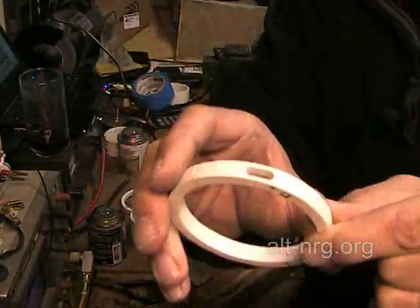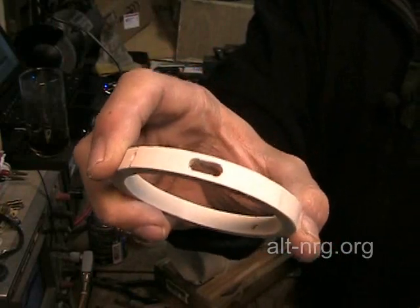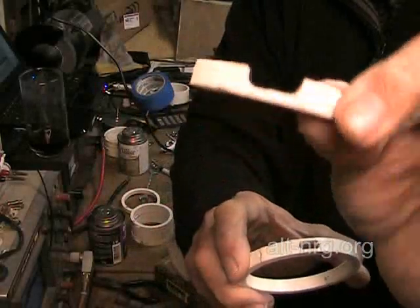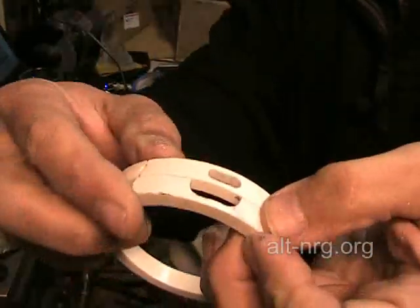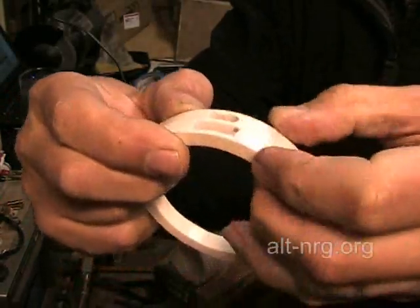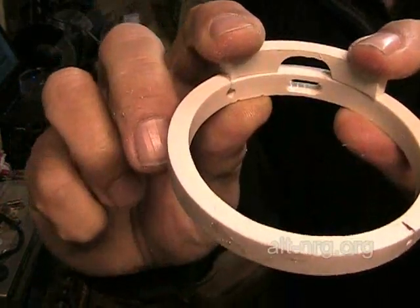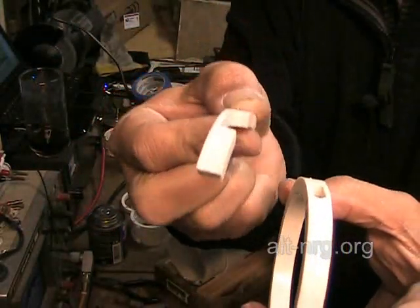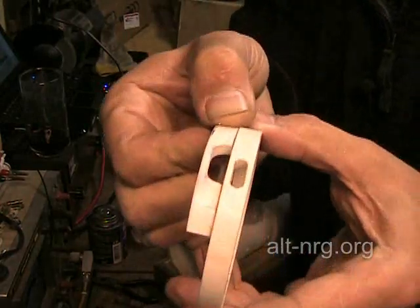This kept the entire section of that opening flooded if the gas volume was not great enough. So what I've done to address that problem — I slept on it last night and awoke with the answer — is I've created a little baffle piece right here. The purpose of this baffle piece is to create a channel whereby the gas has to exit the bottom.